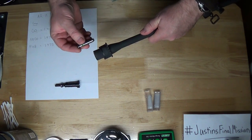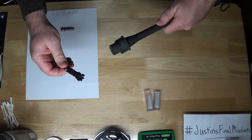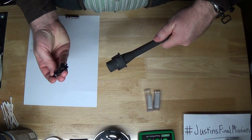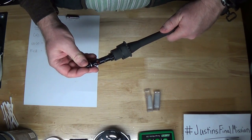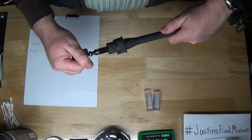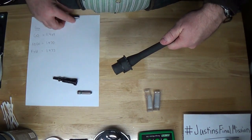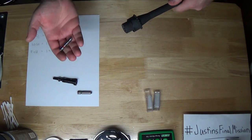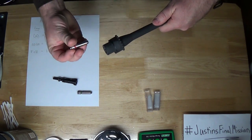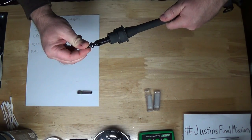This is going to make sure that your cartridge will sit into the barrel chamber properly. I'm going to take my bolt from my AR. I've already disassembled it — I've taken the ejector and extractor out, which makes it a little easier to check. When I put it in, it should spin freely, and it does — no issues there. That means the chamber is bored deep enough. Now the no-go gauge is a little bit longer, and this is going to make sure the chamber is not bored too deep.